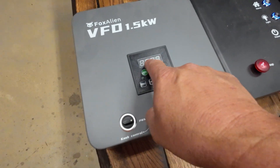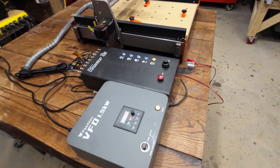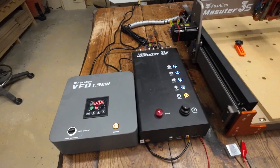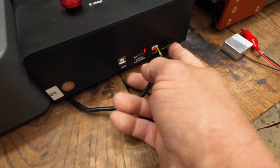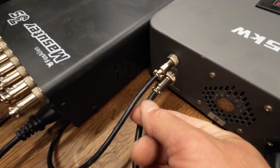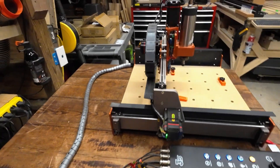It does have a readout that tells you the RPMs of the machine. James did a little testing on that and said to take it with a grain of salt — the accuracy according to his instrumentation was not that great. But there you go. Very basic setup: one wire goes to the controller on the laser output, make sure you switch the switch over, then you've got wall power, spindle output, and the PWM wire that goes to the front. Like I said, that drag chain and cable is going to be the hardest part of the whole operation.